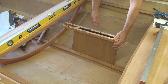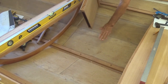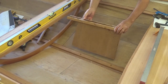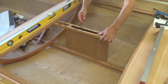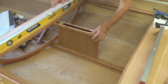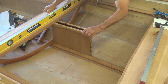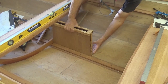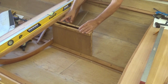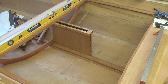It looks a little rough right now, but with a bit of sanding — I did trim the bottom of it on a slight bevel to match the planking in the bottom of the hull. There's a bit of cleanup here to go. There's a cap that's going to go on the end here. Really what I'm looking for is the right height, and it appears that with a tiny bit of shaving here and there, this will go forward right to the frame and get it vertical. There's a slight half-inch wide cap on there — this is a 12.5 inch opening and I really only need 12, so we're getting pretty close.